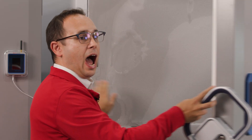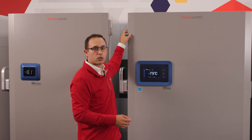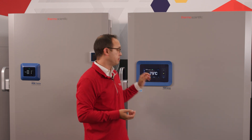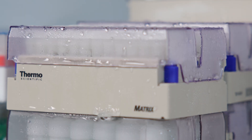Those are typically simpler models. As the refrigerant moves through the coils in the walls, they absorb the energy or heat from the air and product in the cabinet. The internal temperature differential causes the cold air to circulate, resulting in stable cabinet temperature when the door is closed, although places closer to the wall can be colder than the rest of the freezer. The cold refrigerant generally enters the coils from the top of the cabinet and works its way downward, meaning heat removal is happening first at the top and then the refrigerant warms as it goes down. This is typically why you see ice build up the most at the top of the cabinet because it's the coldest point.